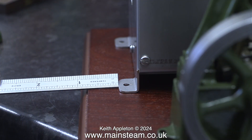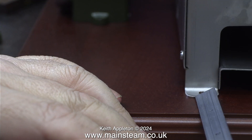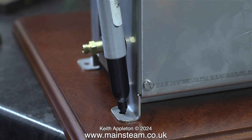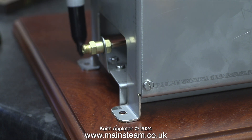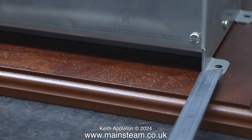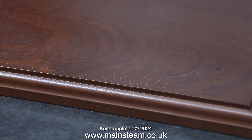Time now to plan the fitting of the boiler to the baseboard, using a steel rule. Exactly three quarters of an inch to the edge at each end puts the boiler in the centre of the baseboard, and at the back the boiler is one inch from the edge — this allows plenty of room for the parts and it just looks right. I'm using a Sharpie felt tip pen to mark the positions to drill holes for the bolts. Be very careful not to move the boiler out of position while double-checking measurements. I now have four spots on the baseboard where I need to drill holes, which will be threaded to take 4BA bolts.